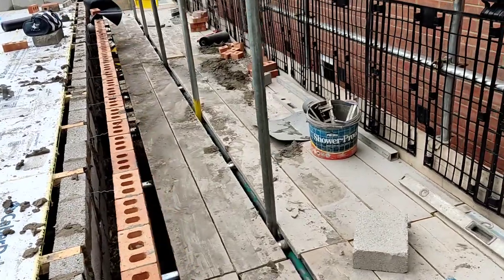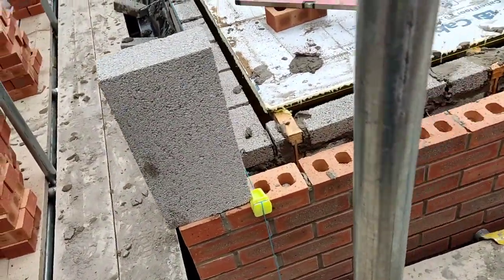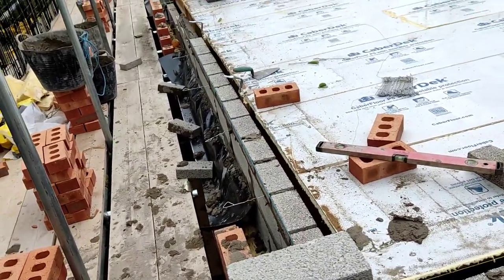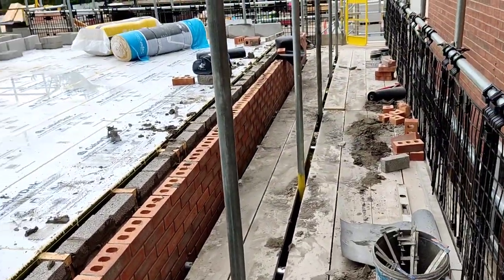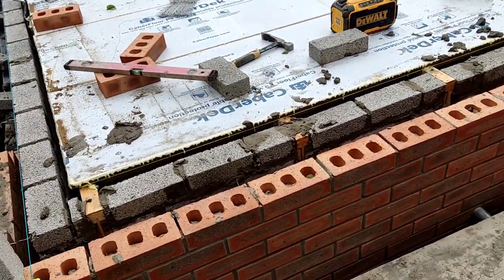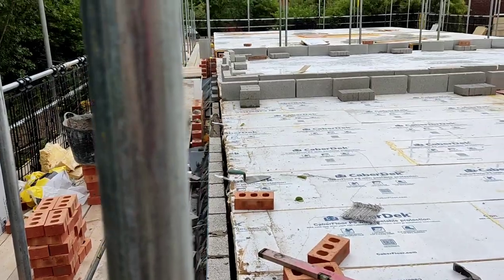Zoom out. Yeah, it's full fill insulation. We took the brickwork four courses higher than the joist, so it's level. We just hook the lines on for this beam fill. I lay it freehand, and obviously just iron it down really. It's full fill insulation. I find if you clean your snots off effectively, you want to really leave them a day. If any snots drop on your insulation and you can't get any wood in, which I'd be all day cutting timber to slide down, you want to leave your gobbo a day to go off on the insulation, then pick it off. Stops it going all the way down the side of the insulation, stops it filling the cavity.